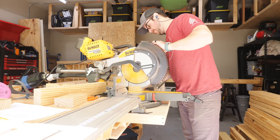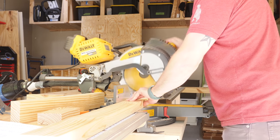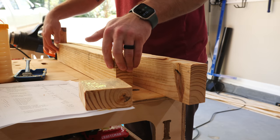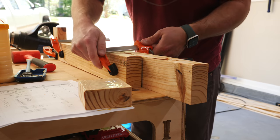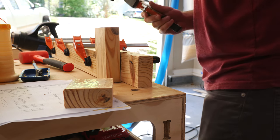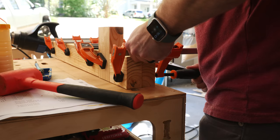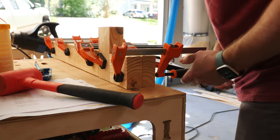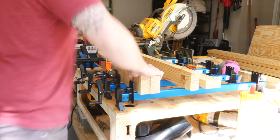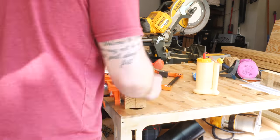While the top dried, I could start working on the legs for the workbench, first cutting down the pieces at the miter saw. I designed the legs so that I could create half-lap joinery during the glue-up without actually having to cut the half-laps, by leaving some strategic gaps. I did still have to cut a few half-laps, but this joinery method definitely saved me some effort. I left the leg stock at that three and a quarter inch width during the glue-up so that I could trim the legs to width and clean up the edges after the glue-up. The front and back legs are oriented a little bit differently, so I did need to keep that in mind during the glue-up.